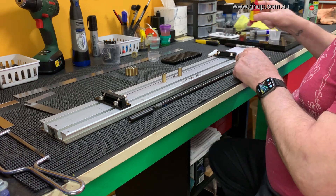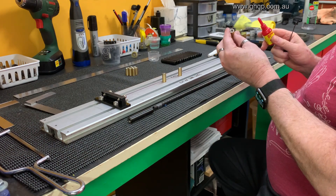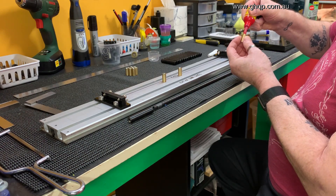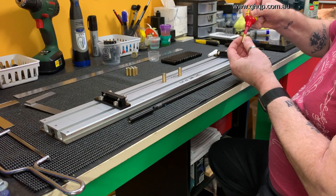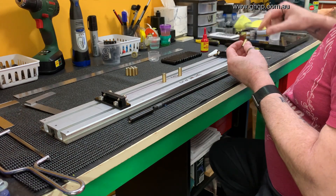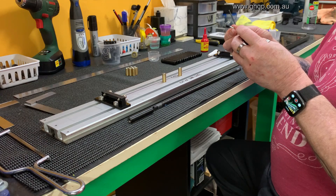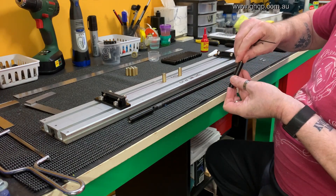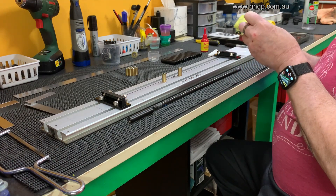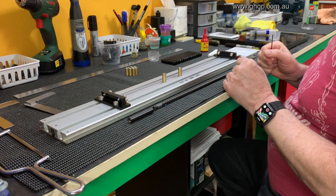What I'm going to do now is assemble the magnetic ends. I've got the magnetic socket — I would call it. I put a little bit of red loctite, which is permanent loctite, into the end of it. That goes up in there. I then got an M3 screw with a spring washer and a normal washer on it that I dropped down into there, screw it up nice and tight, and that's not going to move. That's the first one assembled. I'll now do the other three.